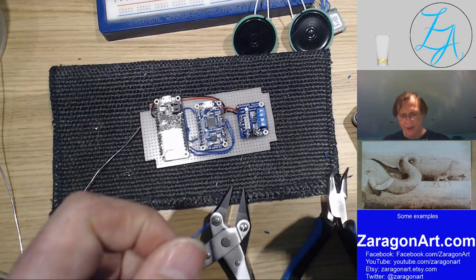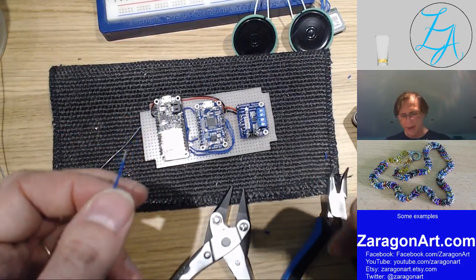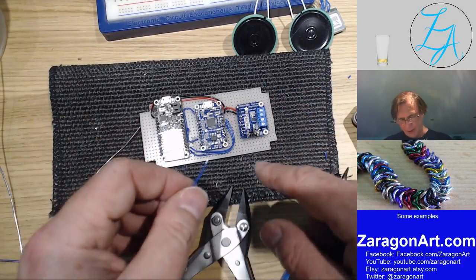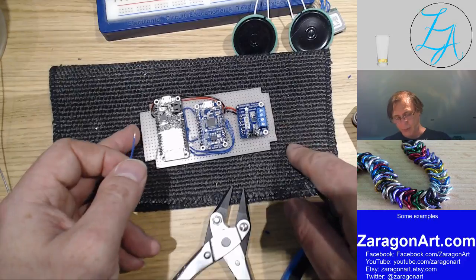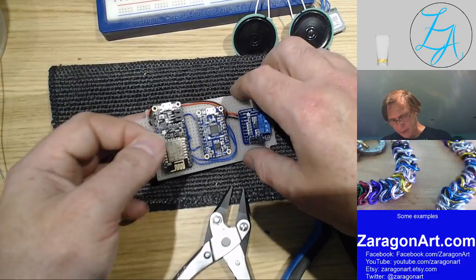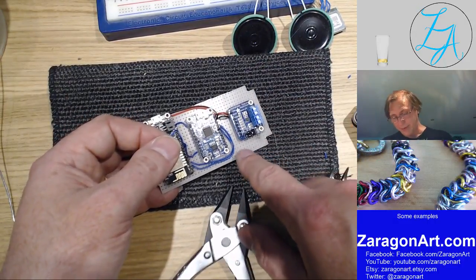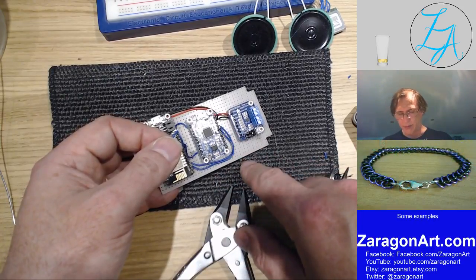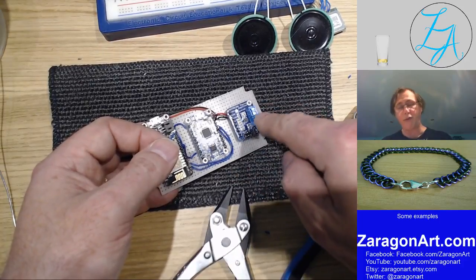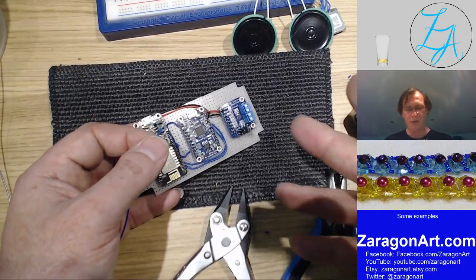What was I saying? Yes, stereo pair. The reason you'd use either a coax or a twisted pair is to reduce noise pickup into the amplifier. In theory, if there was a source of noise, and actually the microprocessors on here are all sources of noise, then they can induce non-music signals by an induction sort of method onto the wires, and then the amplifier would amplify those, just causing distortion or a general background hiss or hum.